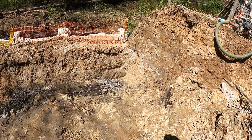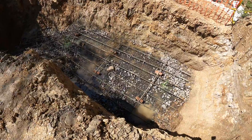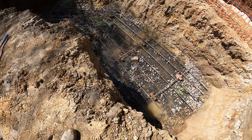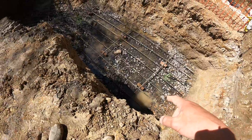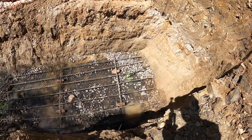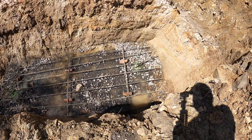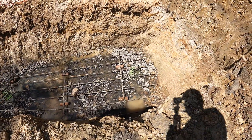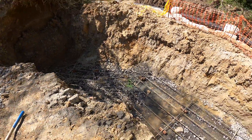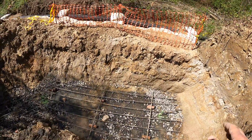So today is a very exciting day — we're ready for concrete. It's been a heck of a battle, but we've made it. You can see we got our rebar set up. We have seven pieces of number five rebar evenly spread out — that's what the plans call for. It didn't call for any short-way pieces, just long ways, but we put those shorter pieces in to keep it up off the ground. The pieces of rebar driven into the ground are there so we can make sure we get an even height across. We got green spray paint on them — that lets us know we've reached at least 12 inches. We did that in three spots: one here, one there, and one around the bend. We'll use that as a guide when we're pouring, then get in there with the screed with a level on it to make sure it's right on.